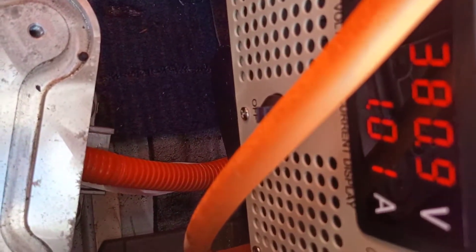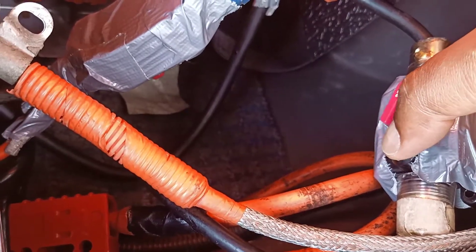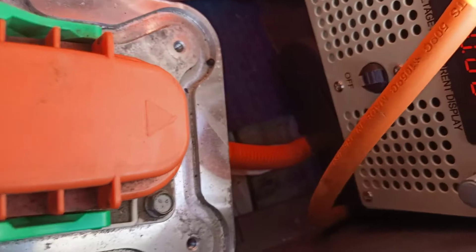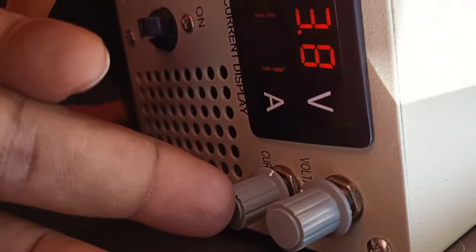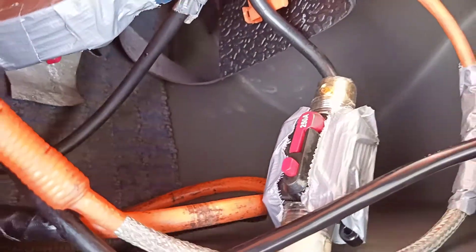Right now the tender charger is not plugged to the solar panel — it's plugged to the wall. How does this charger work? When it's on open voltage, you set your target voltage. At the back you have to find a means to disconnect — there is a positive and a negative leg, and this can go up to 600 volts. I've set the target to 403.8 volts; when reached, the current will drop to zero and charging will stop. This knob controls the current, this knob controls the voltage — all instructions I discovered myself, as it came with just a basic one-page leaflet.